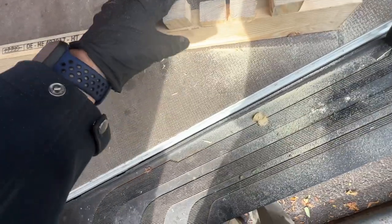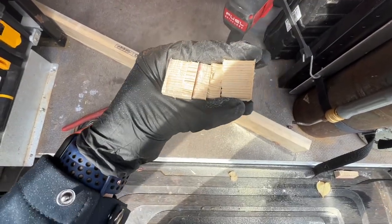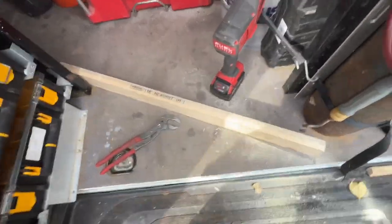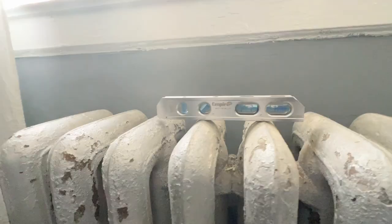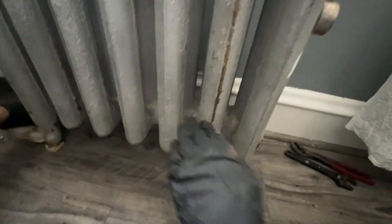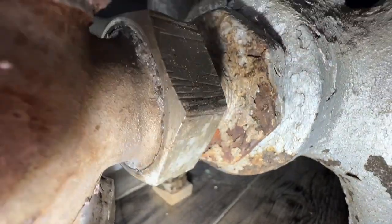While the boiler heats up I went outside and cut some shims — same sizes except the ends are thicker. I always keep boarding in the van so I had that. I lifted the radiator up while Peter got the blocks underneath — thicker on this side, thinner on the other. You can see we've got a nice pitch, a little higher on one side so the water can run down and the steam can come past it.